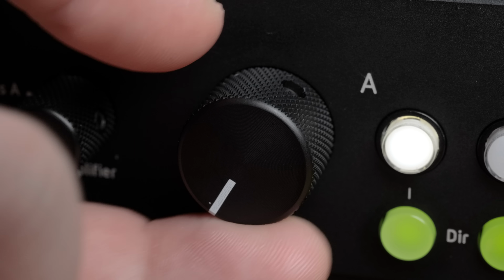And for me personally, as well as just using it to A/B and compare upstream products, I use it so that I can have my main music system playing into input A, bit perfect from Roon or HQ Player, whilst having my PC mix in audio from Discord voice chat, for example. Another little extra mile design aspect here is that as well as being able to control the inputs via the buttons, even if one is active, if you turn down the volume all the way, it will fully disconnect that signal path just to prevent any stray signal from coming through.